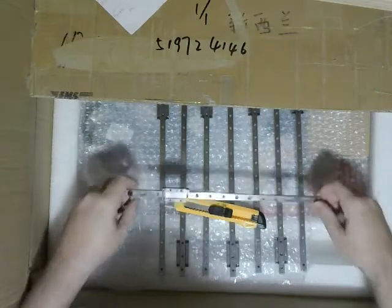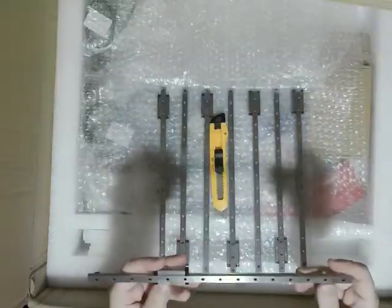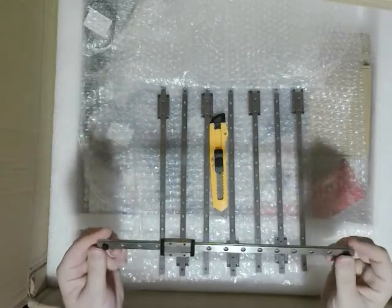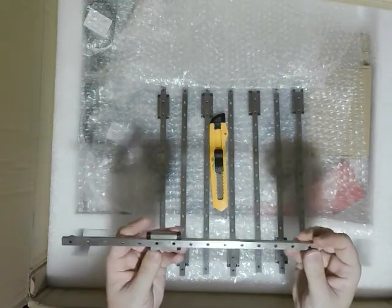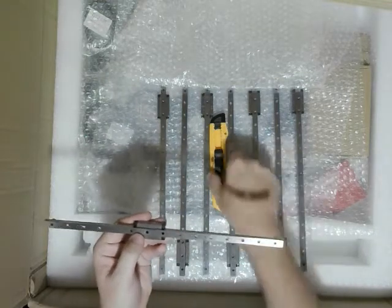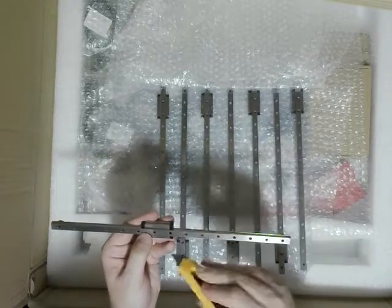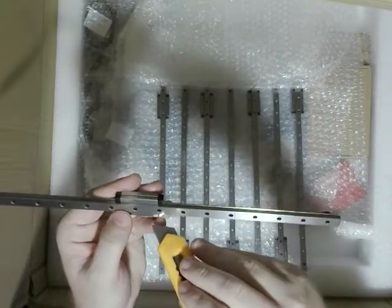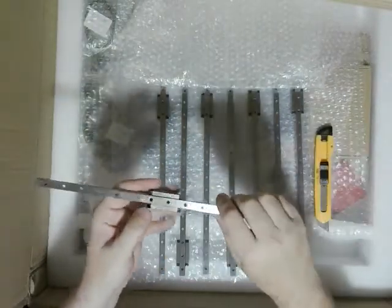I can instead bring it up to the camera. Step one, degrease. Remove the existing grease, then soak, rinse in something like IPA to remove the degreaser, and then using a sharp needle or similar, insert new grease into the bearing races and make a happy ball bearing.